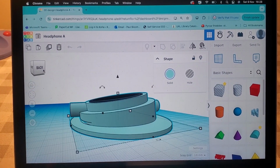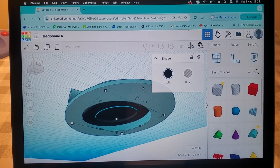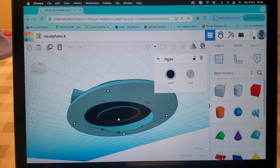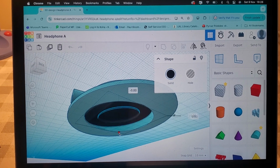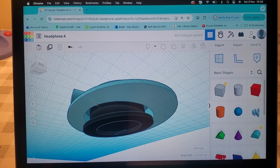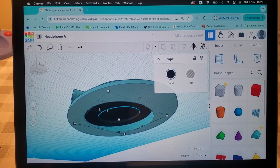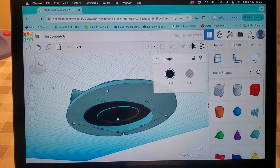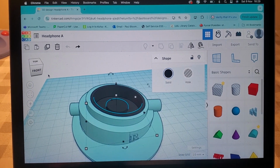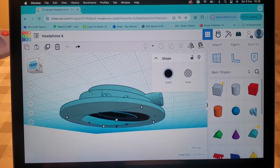And then what I've done is I've angled the entire thing. Now this is simply an unchanged Grado driver housing. That's my intention. So if I move this down, you'll notice there's nothing changed about it. And I've got a cavity there to allow for a bit of staging, and the whole thing tilts on the ear. And if this is the right hand side, you'll notice that it tilts towards your ear by 7.5 degrees.